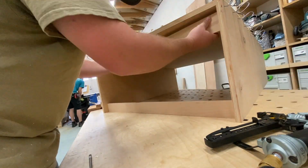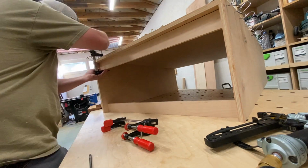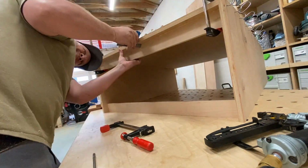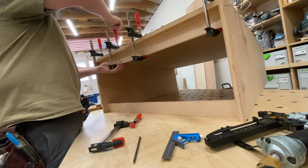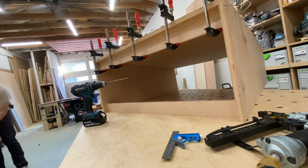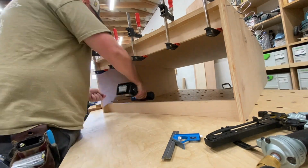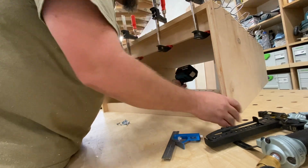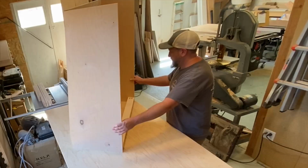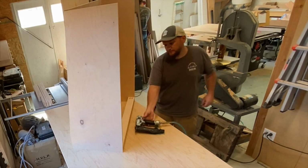Now inside here I'm just building in some support to hold the actual metal unit that's going up inside of it. I'm just going off the dimensions that I've been given. The unit itself is going to get screwed into these when it's all said and done, and there's plenty of play, but that's what these are for. Behind there, there's some screws. Those are called pocket hole screws. They're going in. They're more than strong enough for what this application is for.